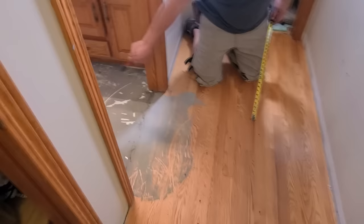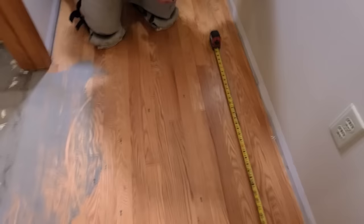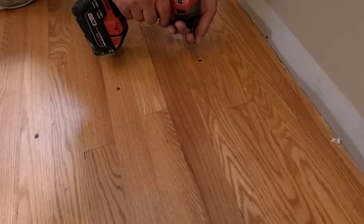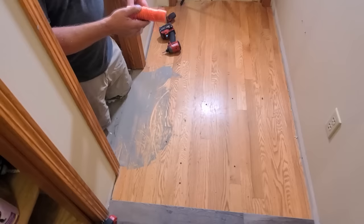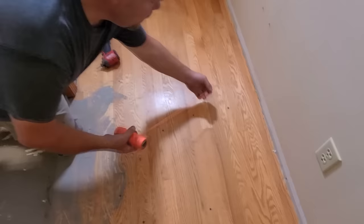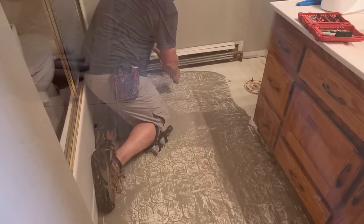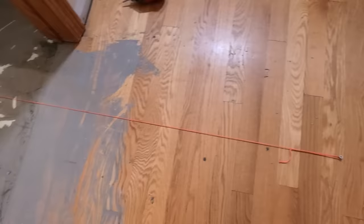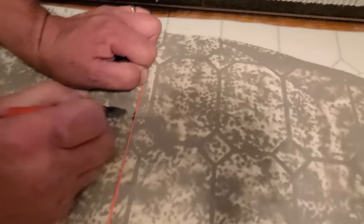I'm going to snap a line through here. I want to get it far enough over so that when I come around with the plank my line doesn't get covered up right away. I'm going to measure out — I'm just going to go with 27 inches. Sink a screw right in the middle of that mark. Now I'm going to take this string line — it has no chalk on it so it doesn't leave any chalk on the floor. I tied a loop in the end of it, hook it onto that screw, pull it really tight and get it over the mark in the floor. Make a mark underneath the string line, slide it over a little, make a mark with my marker — you can see how it landed back on there. It's on there and it's on down there.